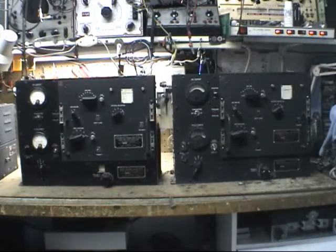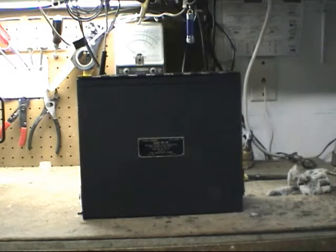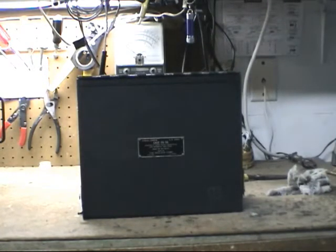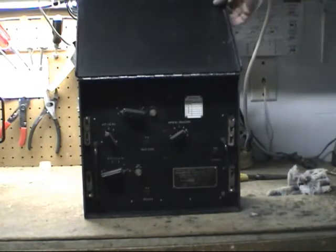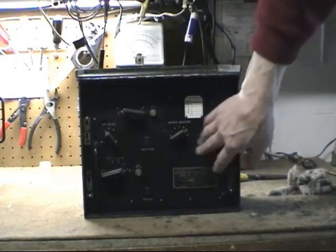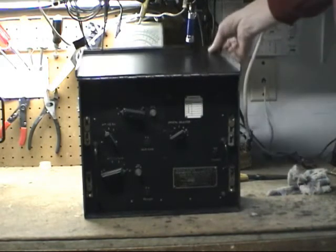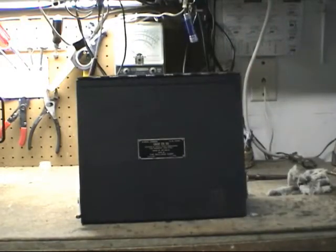That's the major components of the SCR245. The transmitter has three tuning units to change bands, and they would come in this case — the CS56. It's a metal carrying case or storage case, and you can keep the spare tuning units — the one you don't use while the other one's in the transmitter. If you open the lid up, you can see how the tuning unit basically snaps in and is stored just like it would be if you're putting it in the transmitter. You just unsnap it, swap your tuning units, put the other one back in the case, and you're good to go.